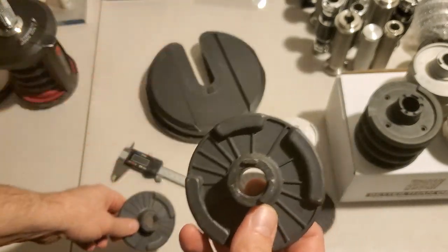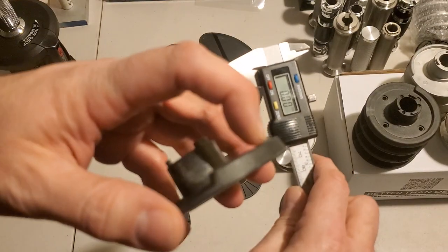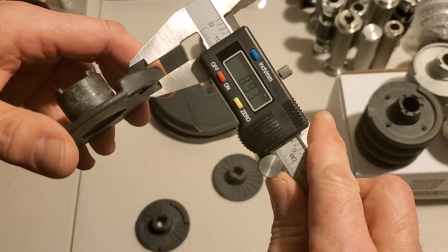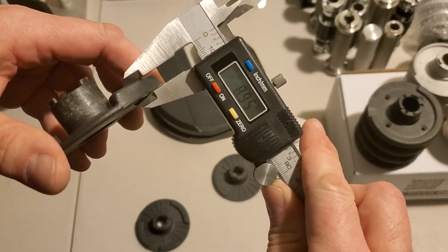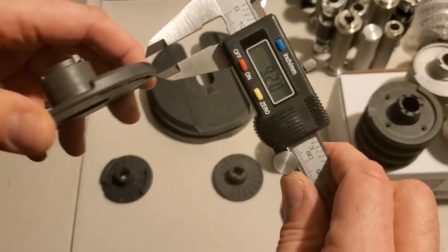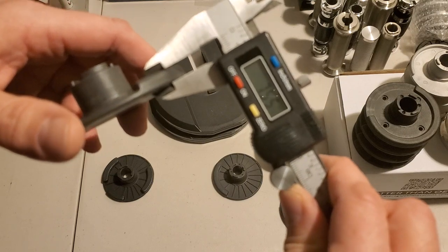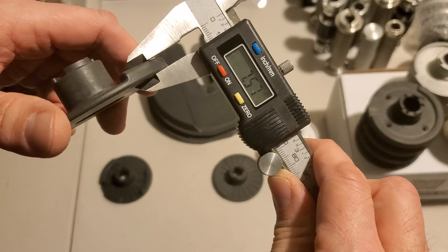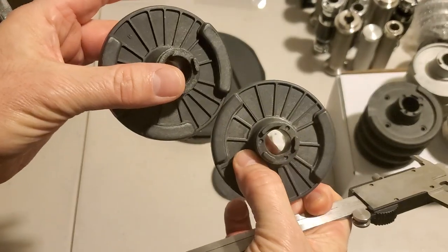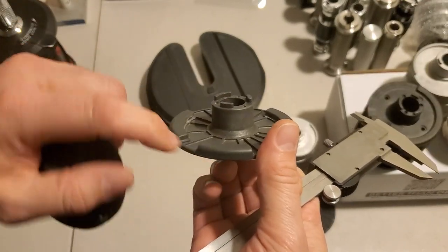Let's see by how much. We're going to take a vernier caliper, fire it up — I've got it in millimeters — and let's take a look first at the lip. The lip on this one is about nine millimeters, almost nine millimeters. And you can already see I've got to shrink it down to seven and a half millimeters approximately for the other one. So there is a 1.5 millimeter difference in height — same disc — 1.5 millimeter difference in height of the lip.